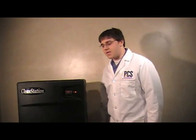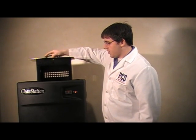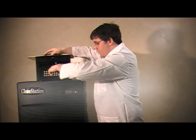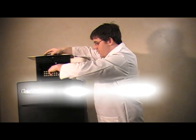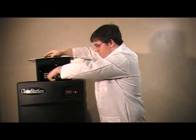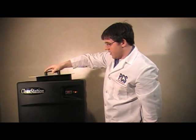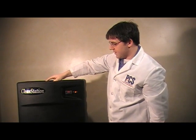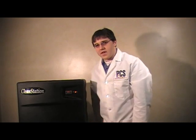Alright, we just got back from lunch. The machine is up to operating temperature. Now we're going to post-process some parts. First thing you do is lift the cage, then place the part inside. For this demonstration, we're actually going to do multiple parts of varying sizes. Immerse the cage back into the caustic solution, press the arrow to restart the pump. Timer's set for four hours. We're going to come back and show you just how long it took to clean them.